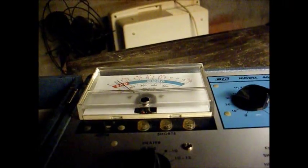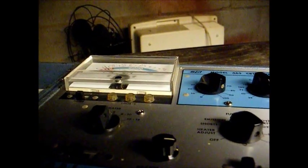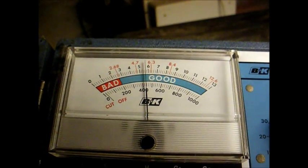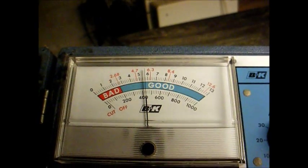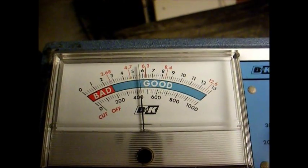Now if we crank the filament up to 8.4 volts we get a little emission. When I bumped it up to the next level it came up briefly and then jumped right back down. We had already tried to rejuvenate this tube on the newer tester and it did no good. This is one of those TVs where, if I restore it at all, I'm basically just getting enough emission out of the CRT to see where we're going with the rest of the chassis until I can find another 17BP4. I hit the button a few more times, saw an arc in the neck of the tube, and now the emission is staying up — but I don't think it'll stay up very long.